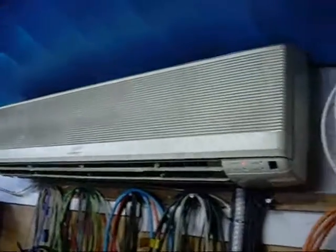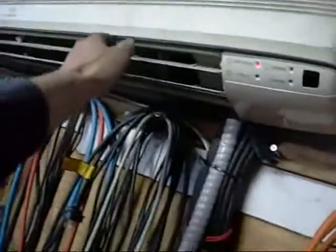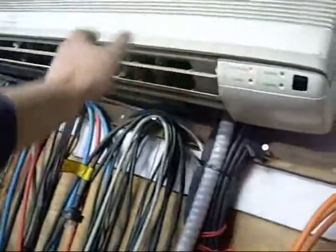This has multiple capillary injection points on it - one, two and three. It's getting there. The defrost sensor will be attached to one of the mid points, so that it doesn't immediately trigger when this happens. There's ice at the bottom. I don't think these things defrost for long enough - I find they start up while there's still a little bit of ice on them. This one's performing very well at the moment. Despite the ice on it, it's still putting out about 35 to 40 degree air temperature at least - really warm compared with the outside.